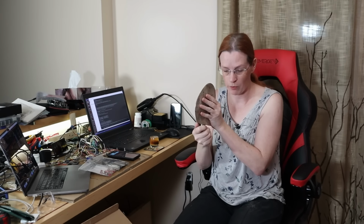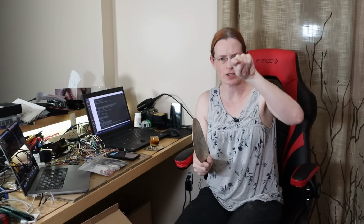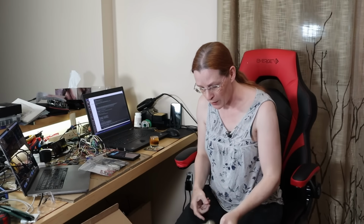It originally came with a 10 inch pitch, meaning that one full rotation, if it was going through a relatively solid medium like sand, which of course you never do, but just for a thought experiment, one full rotation of the propeller would move it 10 inches forward. If you could imagine the threads on a screw and the screw being turned into the wood, it's that kind of idea. The first gentleman I spoke to said, change it to 11 inches and try that.